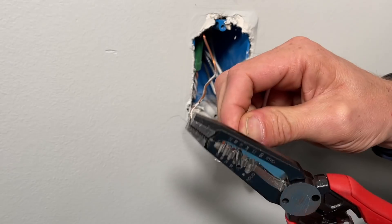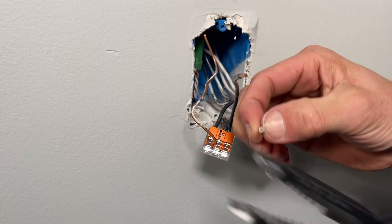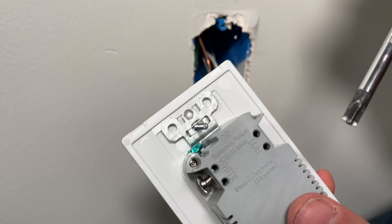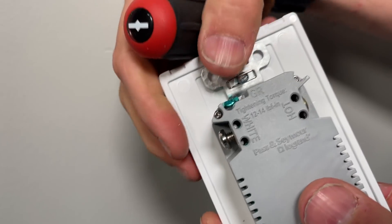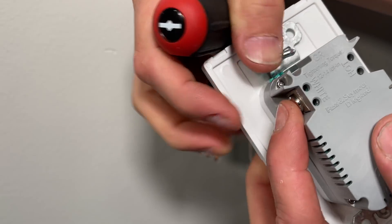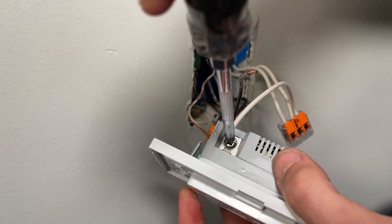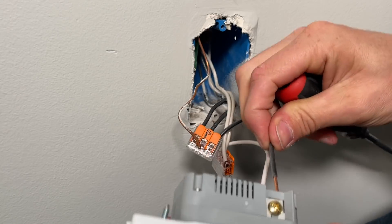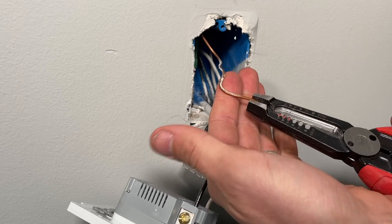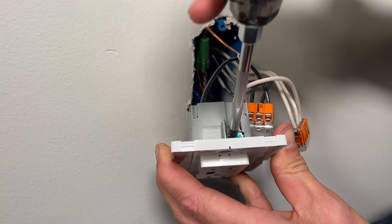This strip gauge is meant for a wiring technique called back-wiring, where you wire straight into the receptacle. There's a small gray plate internally — make sure it's pushed in so the wire goes between the screw terminal and that plate. Then tighten the silver screw terminal for neutral and the gold one for hot, which will pinch them together for a secure hold. Do the same for the ground wire.